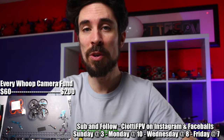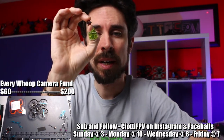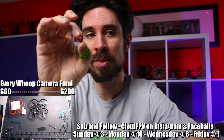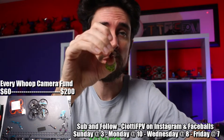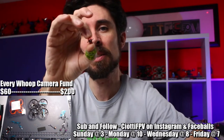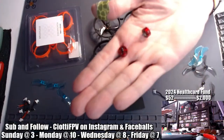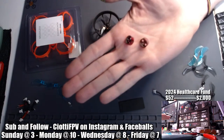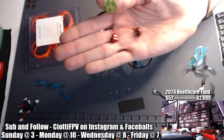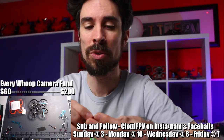So, if you are in need of a Happy Model slash Tiny Whoop 0802 bell, they're all the same. The magnets are all the same. The only thing that changes between motors is the KV, which is the stator. The bells stay exactly the same. So this will work on any 0802 that has a bell that looks like this. They all look like this. This will probably even work on the old school Newbie Drone 0802s.